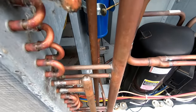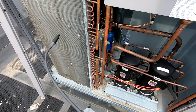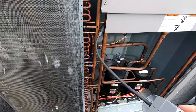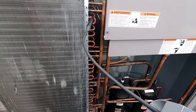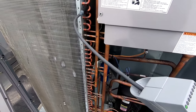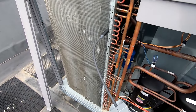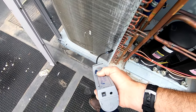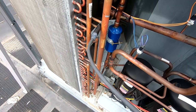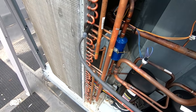The oil is pretty much top to bottom — definitely something right there on that black mark. I wanted to scan all the other areas because the fan will catch it and pull it all over the place. I always scan the back side of the coil too, because it has a tendency with vibration to leak in that area. From what I can see, the oil has just gotten thrown all over the place from the fan motor.